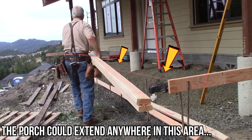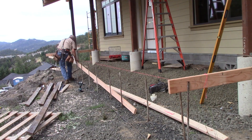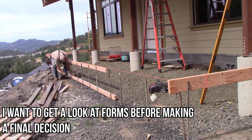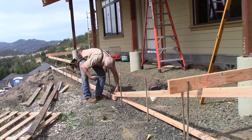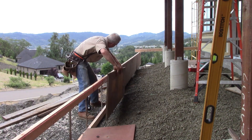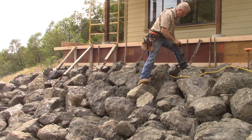The front porch we're forming here is just a little bit technical for a couple of reasons. Number one is that the front face I'm setting up is much taller than the edge form on a piece of flat work like a garage floor. The pressure that wet concrete puts on tall forms grows dramatically as it gets taller. I did some back-of-the-napkin math here and I think that overall, end-to-end, this form could be holding as much as 18,000 pounds of pressure.